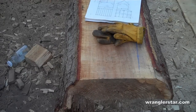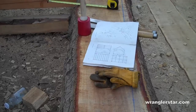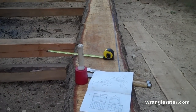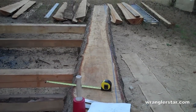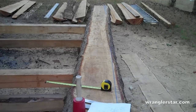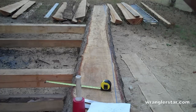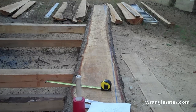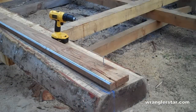Here's the log we'll be working with. This is a white fir that we cut off of the homestead - it's 17 feet long. It's a little bit tricky to work with. If you sight down it you'll see the blue line that I snapped. We've got to get a six by ten out of this, and it's got a real curve in it. Right in that area we're actually going to run out of wood, so we'll have a little wane, a soft corner, but we'll turn that to the bottom on the inside. I think we can just squeak out enough material.